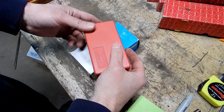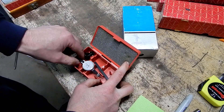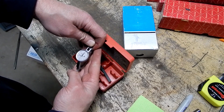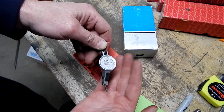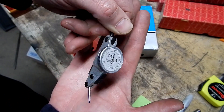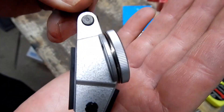Next up we've got a couple of indicators — the fantastic and the not-so-fantastic. Starting with the fantastic: we've got a nice Interrapid. This thing's in pristine condition. This is a 0.0005 — so half-thousandths resolution indicator — model 312B-2. It's very clean. I'm loving the condition on this; I'm a big fan of the Interrapids. Even the stem looks pristine. I'm wondering if this thing's ever seen use.